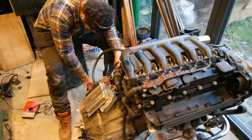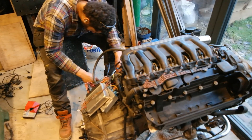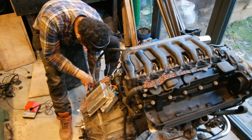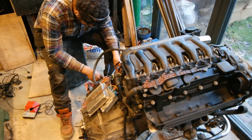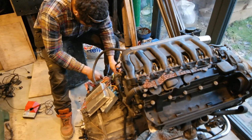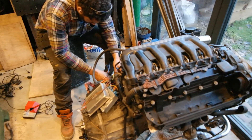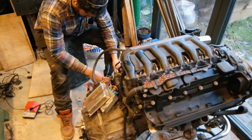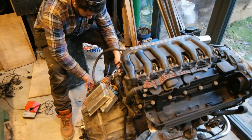I'm going to try this before I hook up this fuel pump permanently because I'm too excited. Right now I can see the pressure going in there — just the default 0.99 bar — and I know I need to get up to around four, or a minimum of 3.5 bar, for this to start, so I'm just going to pump that up.